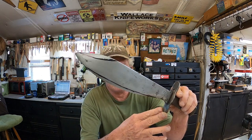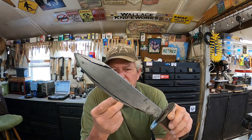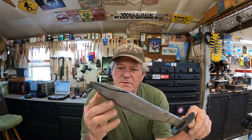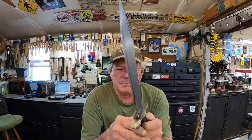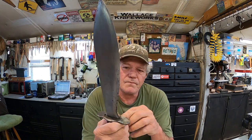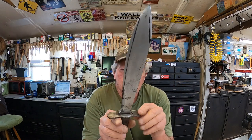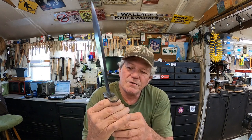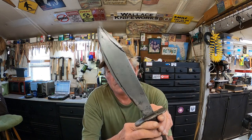And we're gonna make it a Bowie knife. Now this one, I'm just gonna grind the material away slowly, keeping it cool so we won't mess the metal up. It looks like a lot, but it's not really. Then I'll put it on, I think I can get it in the knife jig to regrind bevels on it. Fix all this. The handle's in good shape, just needs to be cleaned up, resealed, and I will also make a custom sheath for this one.